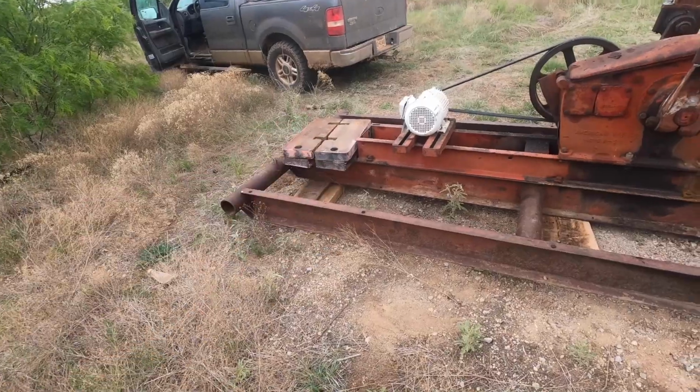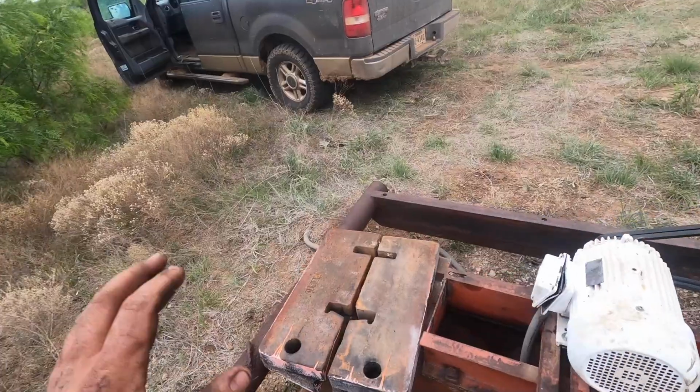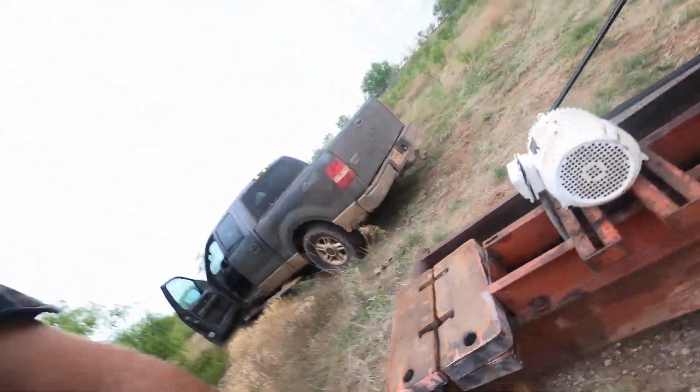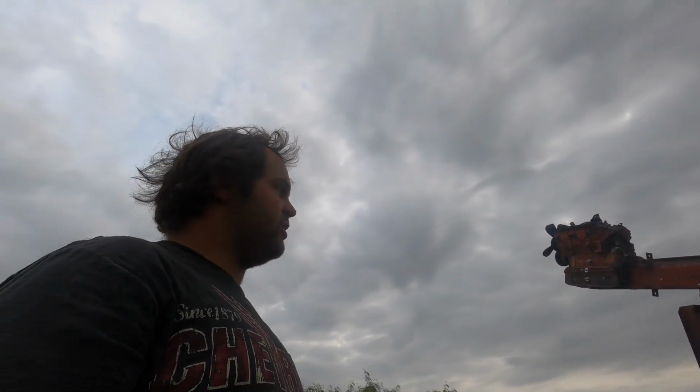I picked them up and just threw them on the back of the skid. Some ballast on the back of these little units sometimes is not a bad thing. Sometimes you got to have it. Also, one thing to consider, this is an 18 American on a 1600 foot well, which is too much for this thing. It's overloaded. It needs a 25.